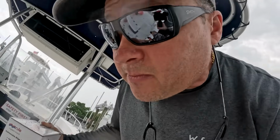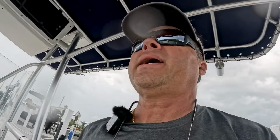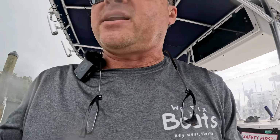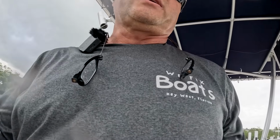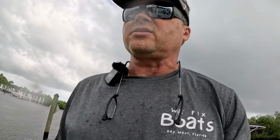So his RPM gauges, the tachometers, are mechanical. They're obsolete. You can't get the pickups for them anymore. It has special little gearing on the back of the engine that drives a mechanical gauge. Well, he's like, let's just use the electric pickup off the alternator. Well, I go over there, I do some research, and his alternators are so old, they don't have electric pickups, so you can't put an electric tachometer on there.